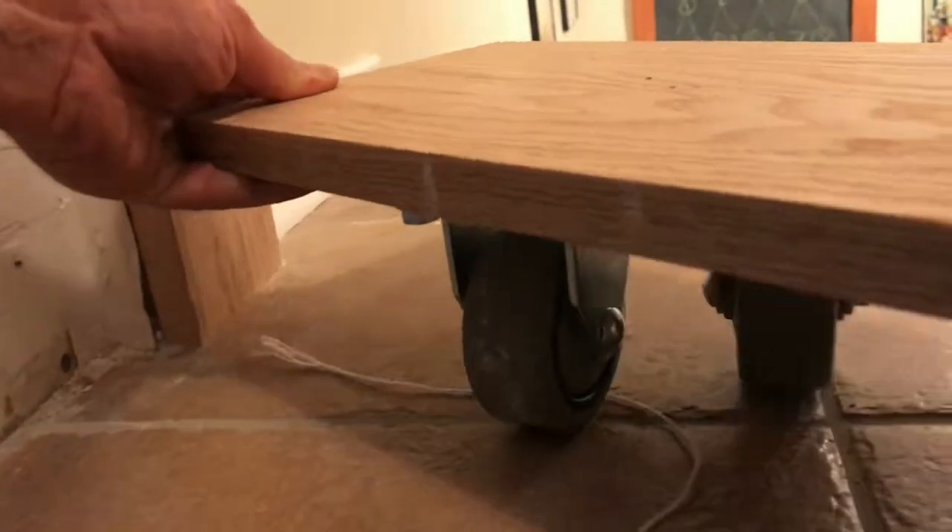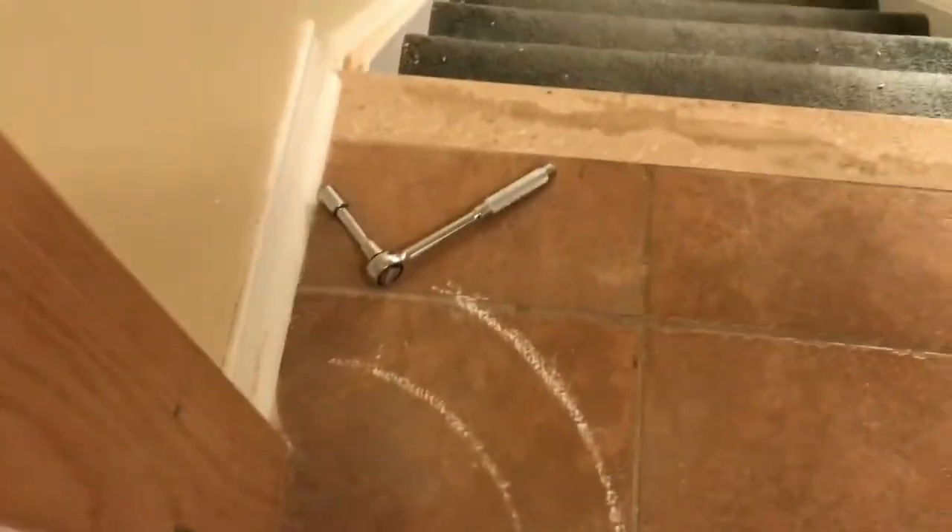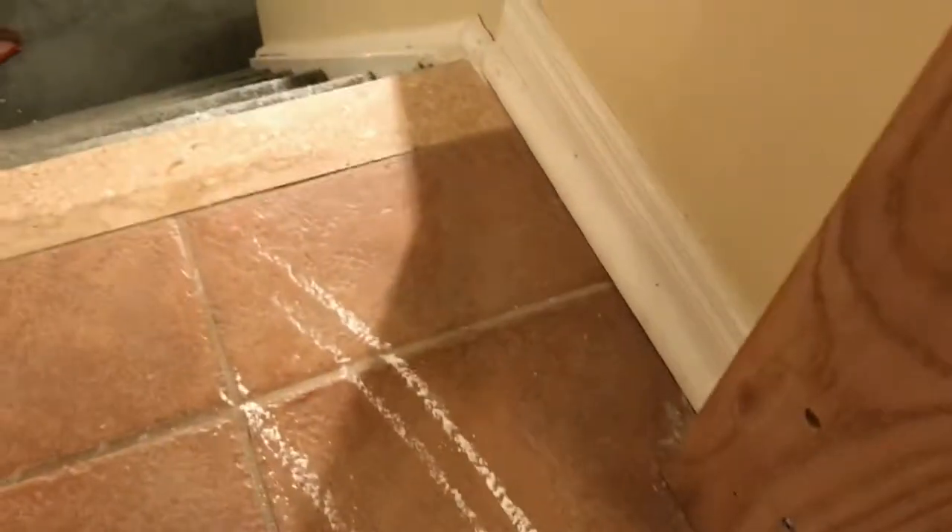As you can see, these wheels, when I hold it right here and swivel it out, roll perfectly along their individual radii. They each have a different radius to swivel on. How I set that is by putting something right across the front, because that corner is the swivel point. Drawing the chalk circles from that point gives me the various diameters, which become more subtle the further out you get from the swivel point, and more extreme the closer you are in.